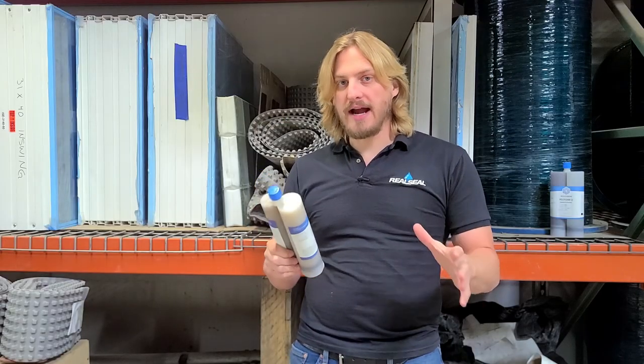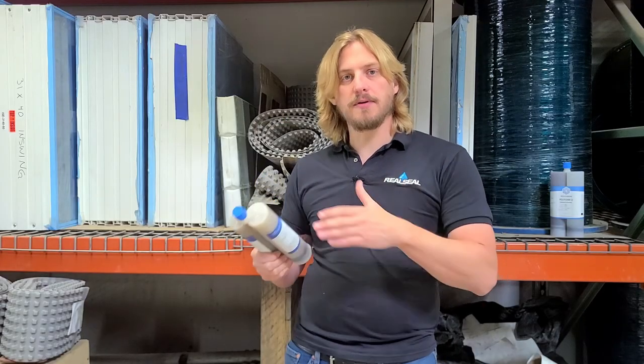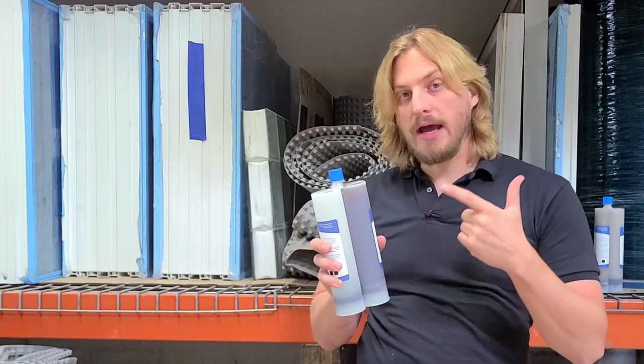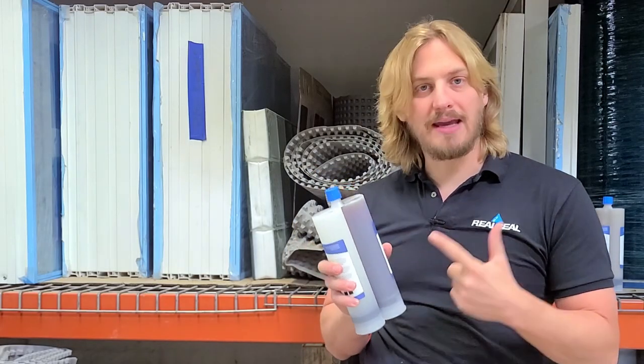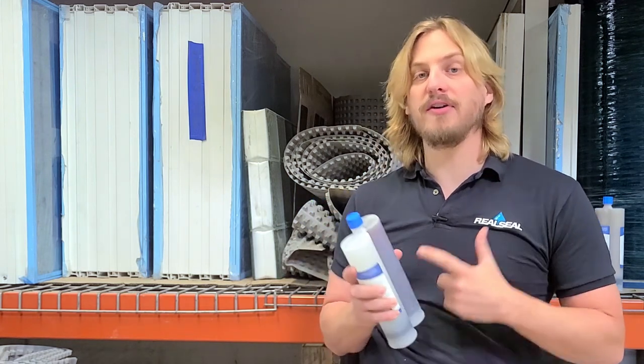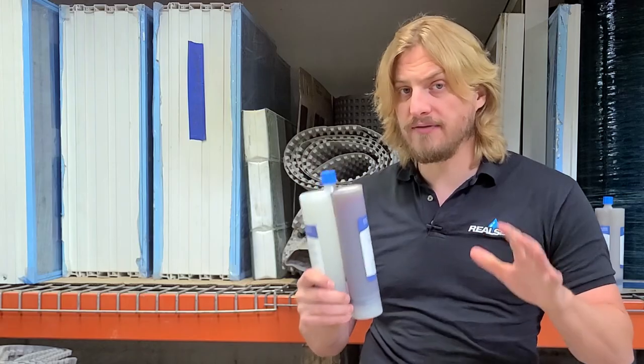And on top of that, if the worst happens and that crack leaks again, it's easy to reinject. If you have the urethane and you have to reinject this, you can't. Because of the foam and all the cells, it becomes very, very difficult, if not impossible, to reinject one of these cracks. So if the company has to come back to do it, they're likely going to charge you to dig out the foundation from the exterior and redo that repair, which is very, very costly.